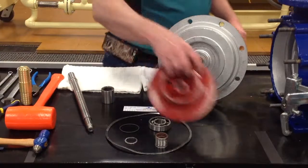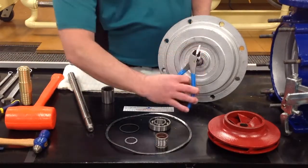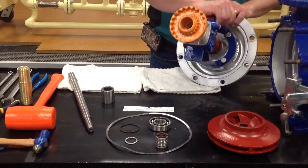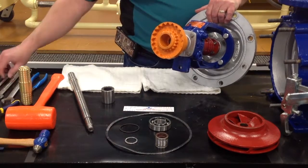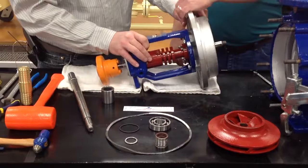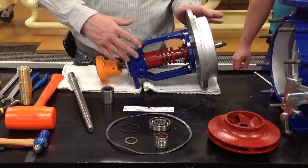As we've taken off the impeller, the next thing we'll want to do is remove the key stop. You can use a set of side cutters to grab hold and pry it out. Once you have pried it out, the next thing you'll want to do is turn it around. You have four 10mm bolts. You'll need a 10mm wrench to take these bolts loose. Jimmy has marked this pump in certain sections before we took it apart to remember where to put these things back. It's important to do so because we want the vent plug at a 45-degree angle here when we put everything back together.